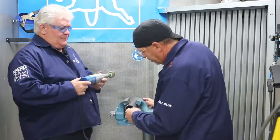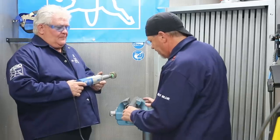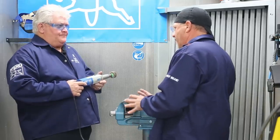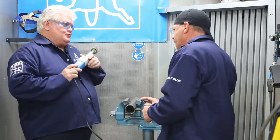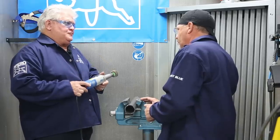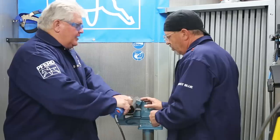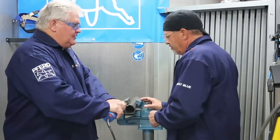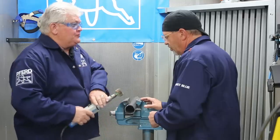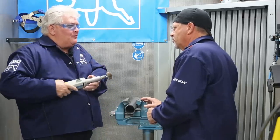So the first thing I'm going to do is reach in here, spin this burr, and get this mill scale off the inside. I don't care about this flashing weld yet. When you're coming to the outside, you're going to draw against the rotation of the wheel. When using this inside, you're going to go in and out like a toothbrush. The reason you go in and out is so you don't groove off the flap wheel and start tearing it apart.